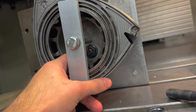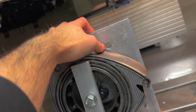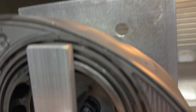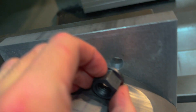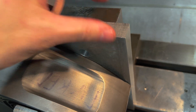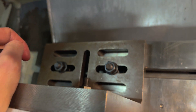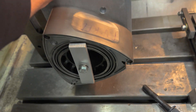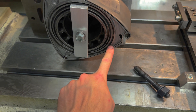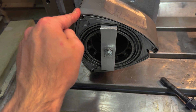Pretty much the same jig - I've got a bolt hole put in there now so it drains out with coolant. I put it here but I need to bring it up a little bit, so I might make a little spacer to bring it out so it sits just about right - clamp through all of that. Tomorrow it will be programming that up and machining it out, and then I'll try and do a full run on one side of these rotors on the back side, then do the slot.